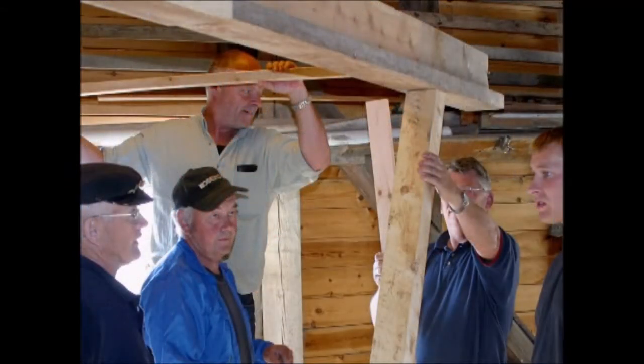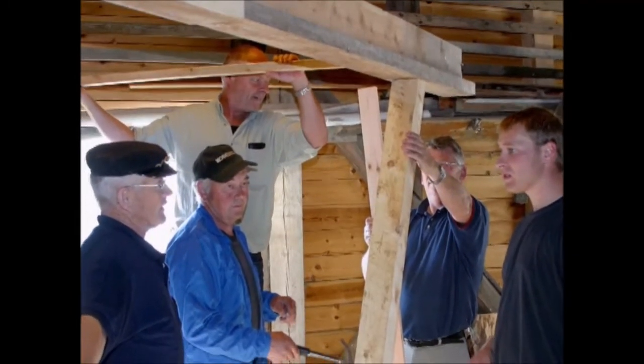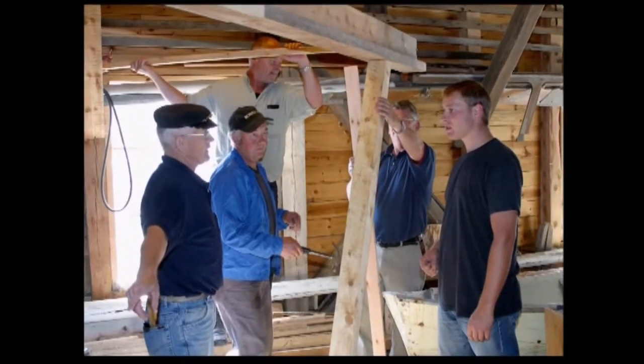The first task for the men is to make a jig, or a frame for the fairing. At the bottom we have the lower jig board, and above the upper. These temporary boards are used to position and adjust the flare on the strakes with temporary trusses.